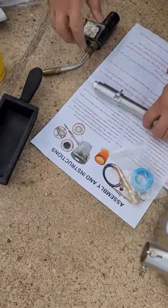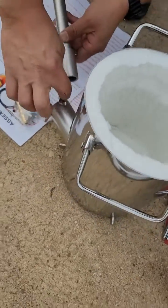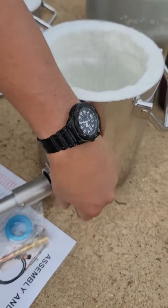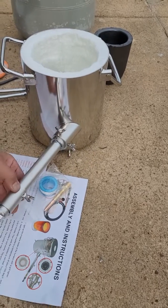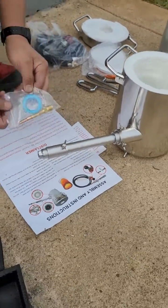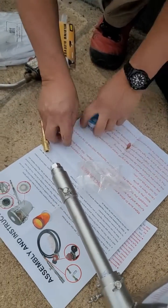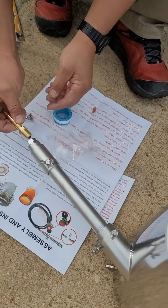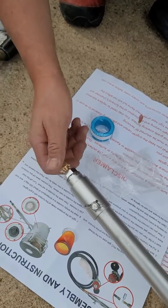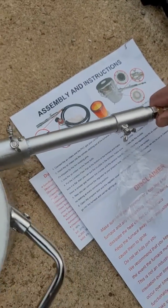I also made a little spoon from a piece of pipe to remove debris when melting materials that aren't clean. Now let's install the connection. This connection attaches with butterfly screws and needs to be extremely tight. This part controls the airflow and combustion — essentially the pressure. The fitting has two threads that look almost the same, but it actually goes in the opposite direction — all the way inside. That carries the propane gas into the furnace.